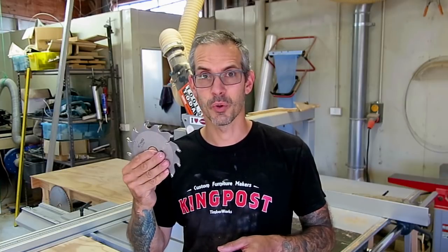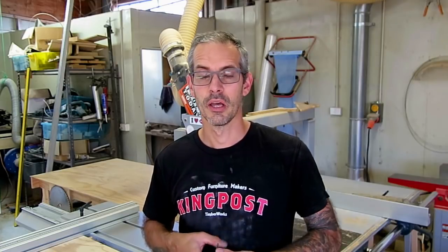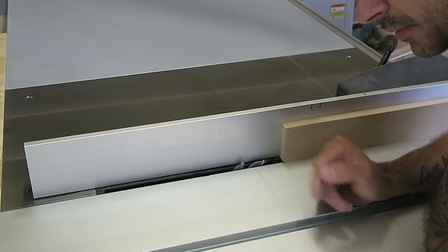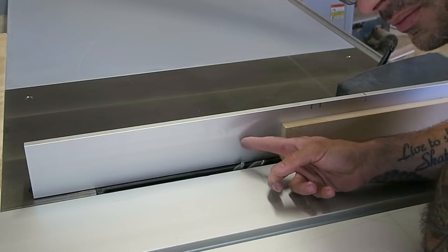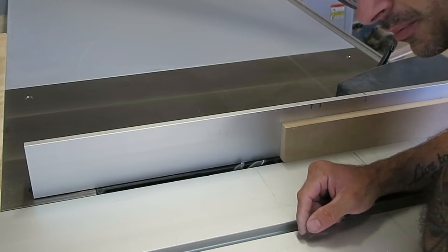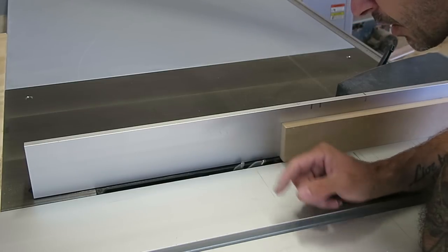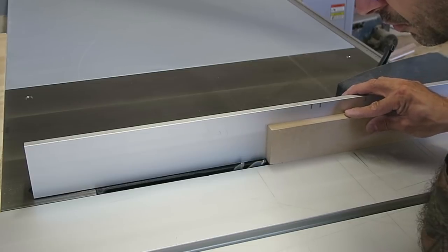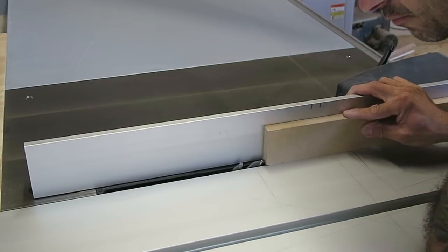So I just have this one because typically I use 6mm panels for most of my doors. Because I use a 6mm panel most of the time, and I have a 6mm blade, that can cause some interference and make it difficult to fit the door together. So I found the best thing is to mark as best you can the center of your panel, or rail or stile.